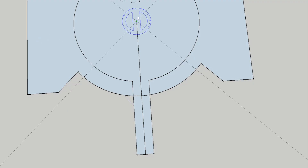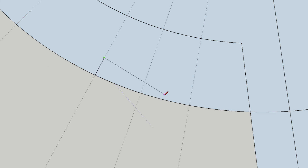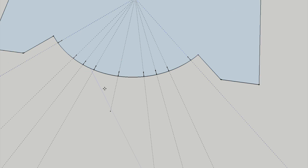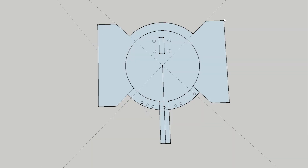This seemed pretty good, but I have to keep in mind the ply on the prototype is much softer than the intended birch ply for the final version. I then altered the SketchUp file to include positive stops at 45, 30, 22.5, 15, and 0 degrees. Once I've attached the saw I'll be able to adjust the fence to make sure these stops are correct — providing I haven't made any mistakes in the file. Feeling confident, I exported the DXF file and prepared to cut the parts on 18mm birch ply.